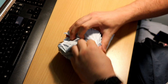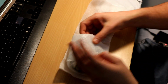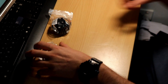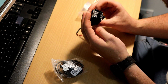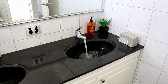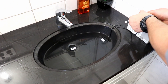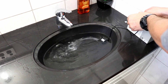My DC water pumps have turned up — I got two, they're 12 volts and the running current is about 350 milliamps. I've been waiting a while for those, so now I can go ahead with the watering system, and of course I couldn't wait — I had to give them a test. These pumps were only about six or seven dollars each, so pretty cheap, but they're rated at 280 liters per hour — maybe it's accurate, who knows.